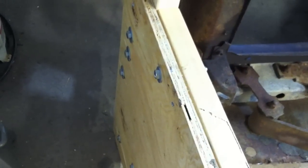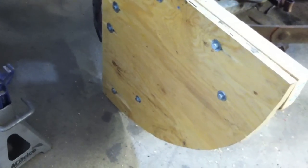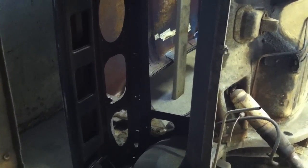That's how I would do it if I had more weight, but this car is super light. The weight is hanging on the frame in the back too, and it gets transferred to the 2x6 using the bumper mounts, straight down to the ground. So most of the weight right now is sitting on the corner of those boards, and that board on the inside is basically just balancing it — there's not that much weight on there, which is why I can get by with those smaller brackets.